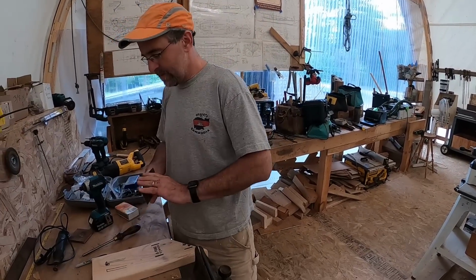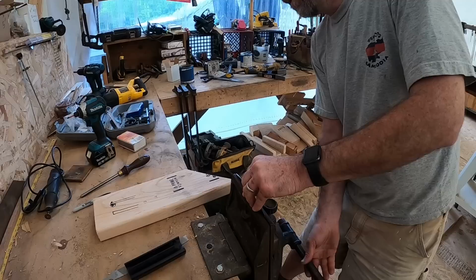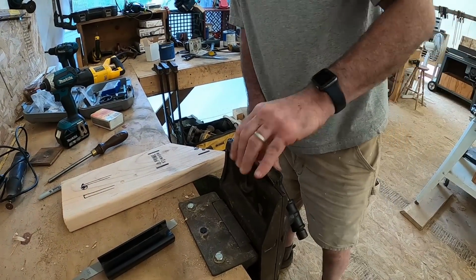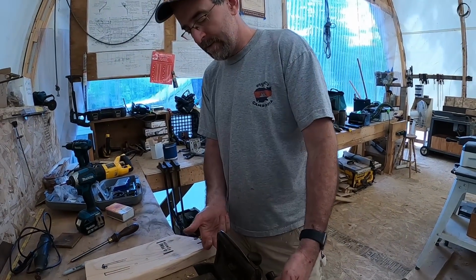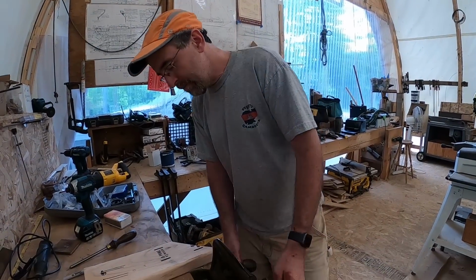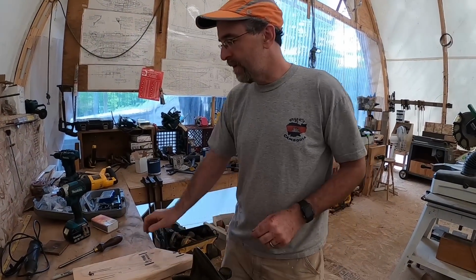Alright, so in theory that's a relatively smooth surface, the hooks are gone, and I'm going to use this super fancy vise, which I normally wouldn't be squeezing a scraper into this type of metal vise, because I worry that the underside here would get flattened as I'm tightening. But because this device allows you to change the angle of the clamping, you can make it so it's pointed at the top and it's actually going to be grabbing in the middle here.